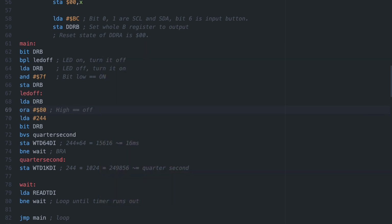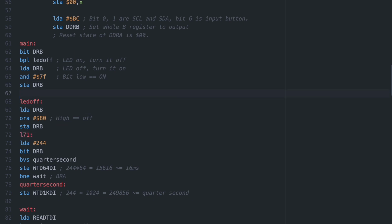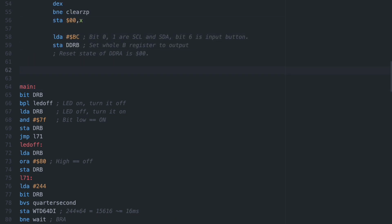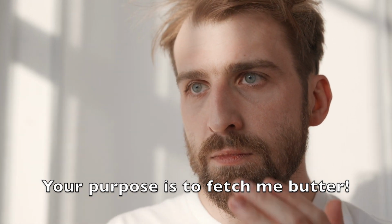Now that our Blinky code is fixed, we can get back to what we came to do. Let's get the display running. To initialize the SSD1306 over I²C, we have to tell it a bit about the module it's part of. It doesn't even know the resolution of the display itself. Kind of like a person who doesn't know anything about themselves when they wake up in the morning until someone tells them. Don't we all know a movie where that happens?